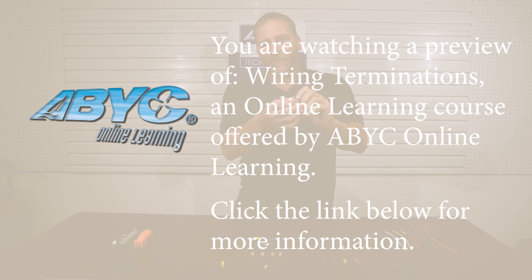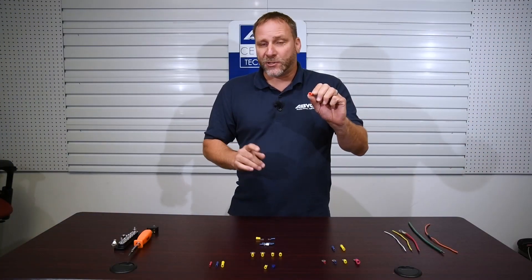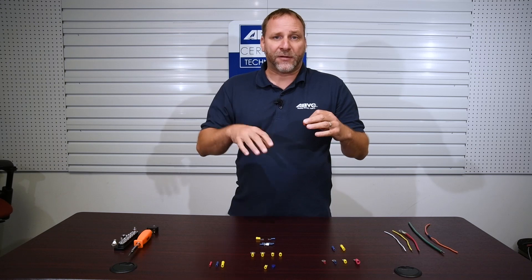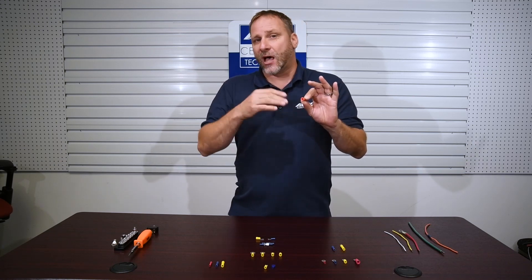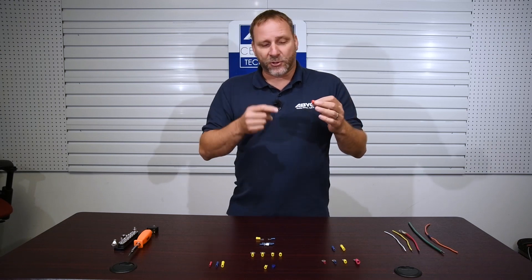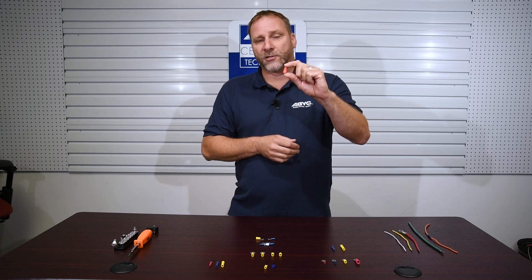The inside of the wire nut — the part that actually grabs into the wire — is made for threading onto solid wire. But we're using stranded wire. When we put that cap on the strands, it usually just moves the strands around and actually has a habit of cutting them. Also, the inside of that wire nut is typically made of steel, which is not going to hold up in the wet marine environment. There's no way of sealing it up either. People wrap electrical tape and put caulk in there, but none of it works. Do not use wire nuts — they are not acceptable or approved for use on board boats.